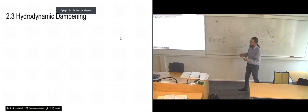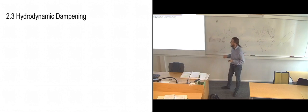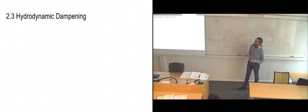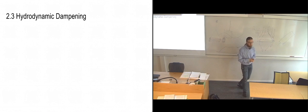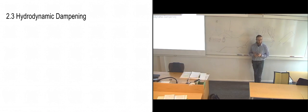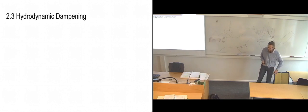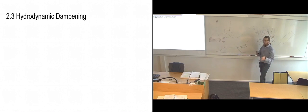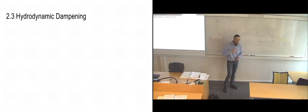The same principle they basically used for those semi-trucks, you can use for a ship or for an ROV, because you get the exact same drag, only it's a lot more negative effect with drag in water because of the high density of water. So it's going to act much more upon our object than it does with a car. So for an example, in my bachelor thesis, we did these computer simulations on an ROV in order to see what kind of coefficients we would get from it.